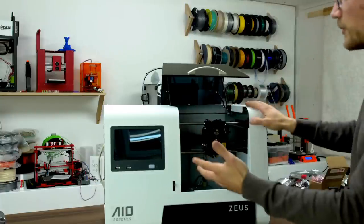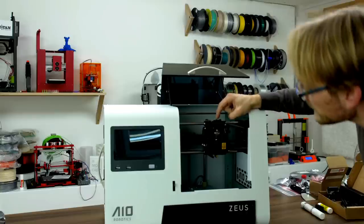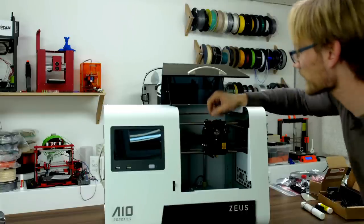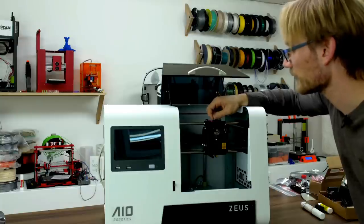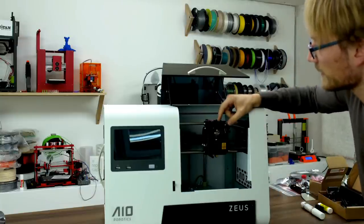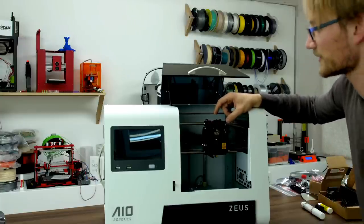Yeah, so the 3D printer part right there is relatively traditional. However, detail right there, this is an encoder wheel. That's the first time I'm seeing that. There's something in the, ooh, there's some gunk left over in the fill-in path there. That would have not ended well. Anyways, encoder, so that's a filament run-out sensor and actually a filament grind-through sensor, more or less.